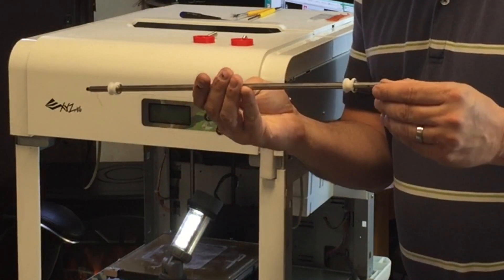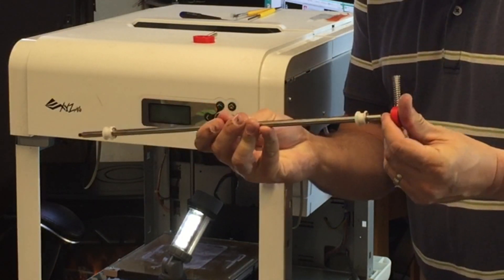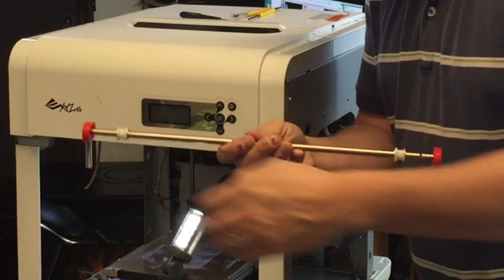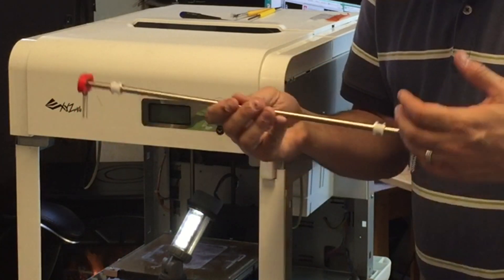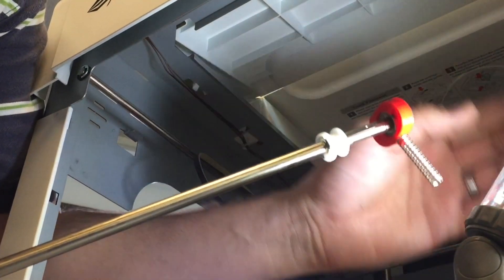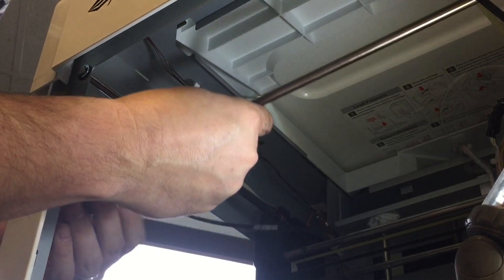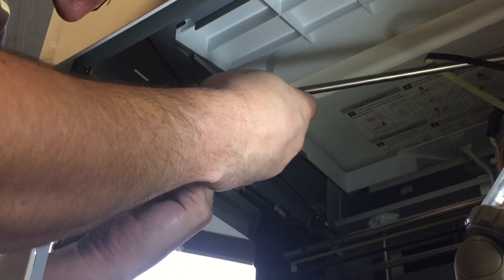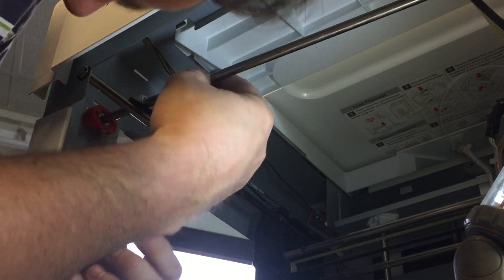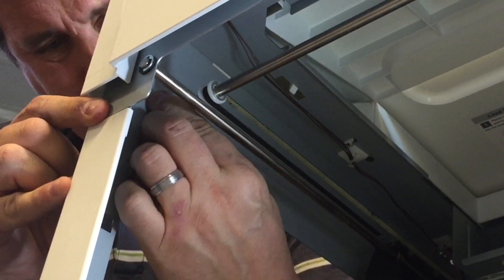Now what I want to do is just get the shaft out. I took the belts off, so now all I need to do is just put these on both sides, and then I can mount this inside. I've got to make sure the belts get around this before I tighten it up. I'll put the shaft in, first get the belts around it. I actually have to go above the shaft here — the bearing popped off. I've got the belts on, the shaft is in place. Then I put the belt on the pulleys, lined up the bearing mounts, and just tighten the two screws.